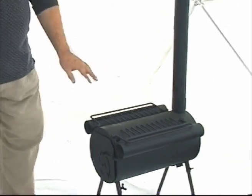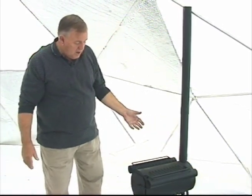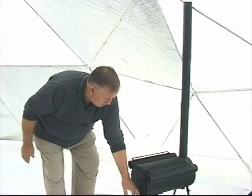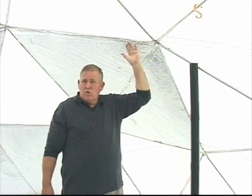It's large enough that you can cook on top of it — it's a wood stove, of course. You can get some of the little fold-up ovens; Coleman makes one that you can set on top to bake bread and the like. It has air control so you can regulate the amount of heat output so it doesn't get too hot. It has two more lengths of exhaust pipe flue, and we have a special ring you can install with the kit that goes through the fabric, giving you a good fireproof flue jack to the outdoors.